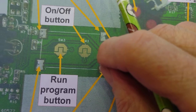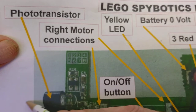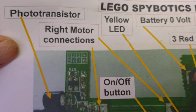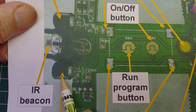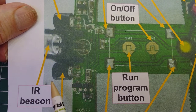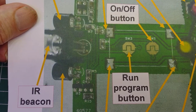The SpyBot comes with a built-in program, but that's lost as soon as you program it with something else. At the front we have a photo transistor, which is the one that connects to the PC. The PC has an LED on it which shines a light on this, sending signals to the microcontroller which presumably saves the program in the EEPROM. We've also got this red LED which, when programmed, connects to the PC via a photo transistor — so this can send signals to the PC via light.